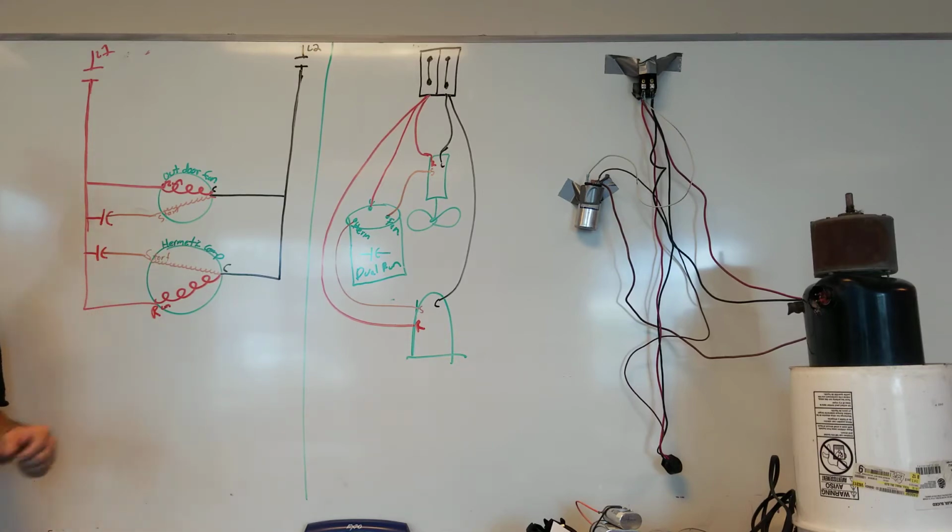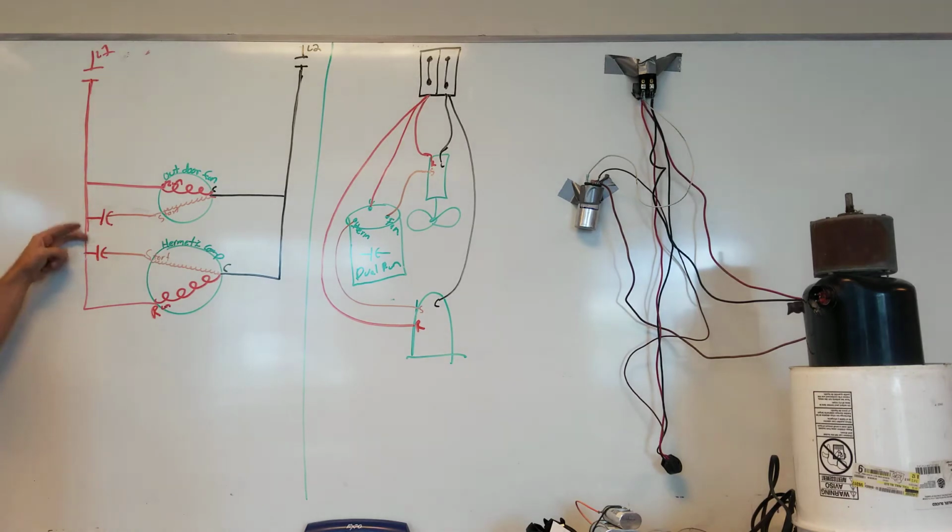Now, I would like to note that most ladder diagrams, even if it's a dual run, will demonstrate it like this because it doesn't care if it's a dual run or a single wiring, it's still getting its power from line one either way, to help you understand it.